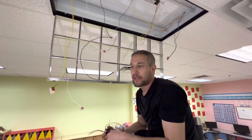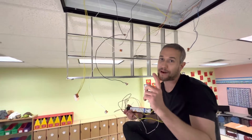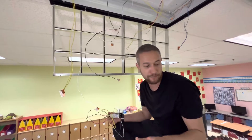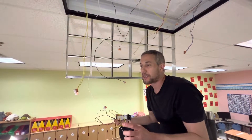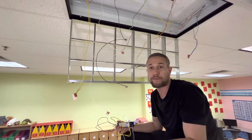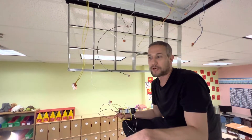In my opinion this is the best solution to check if a ballast is really working or not. But a safer alternative: instead of doing it this way, you could make a portable fluorescent light — whatever size you're using. If you have a bunch of used ballasts, you can build a portable tester, plug it into an outlet, and just turn it on and off to check them, instead of dealing with the hot wire directly. That way it's going to be safer.